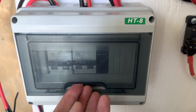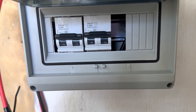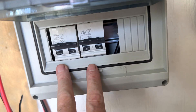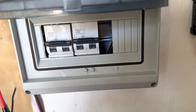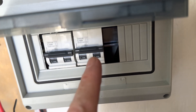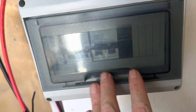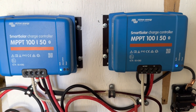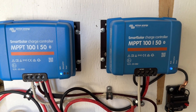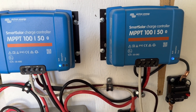Got the cover on the isolator switch for the solar panels. Now before I'd ever come in here and work on anything again, I can just flip the solar panels off, disconnect the battery, shut everything down, and disconnect all the breakers before I start turning wrenches — which is what I did today. I didn't have this second isolator switch hooked up to the EP Ever before, so I went ahead and tied it in today. Now everything has very fast disconnect switches. Side by side, both Victrons working, pulling almost identical — I'm calling it identical. I'm pumping close to 60 amps of power into the battery bank.